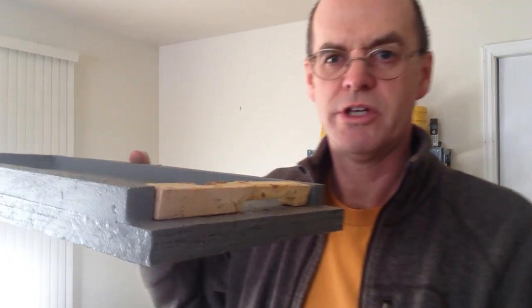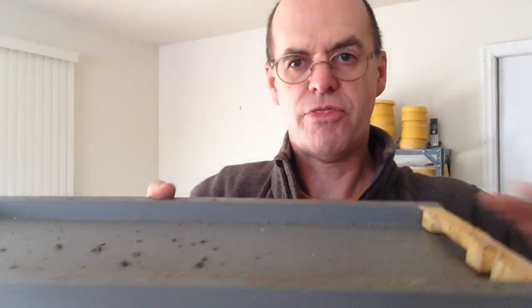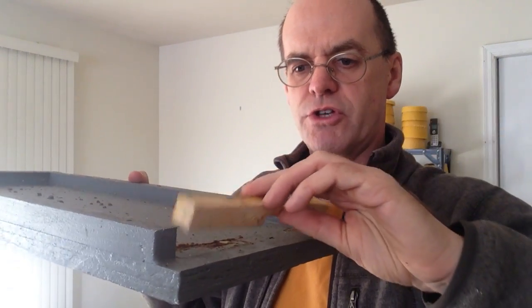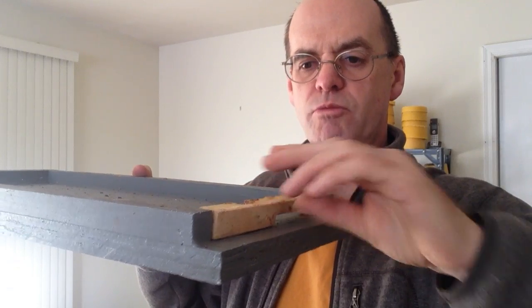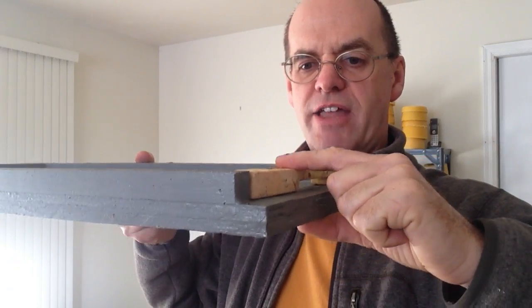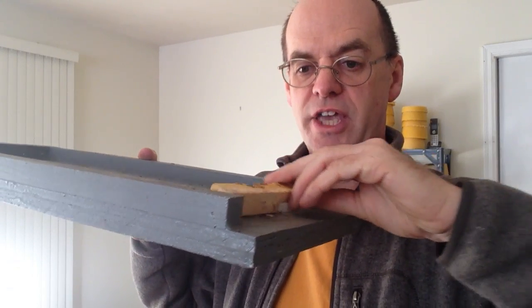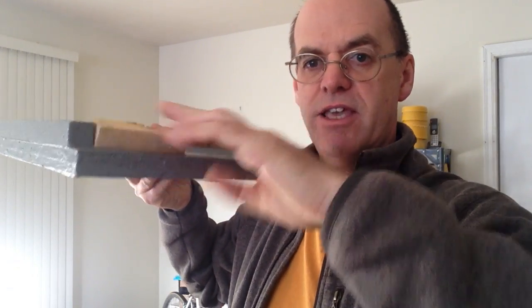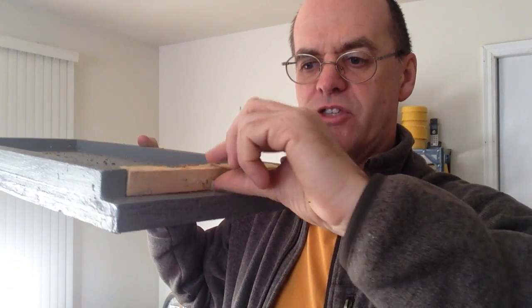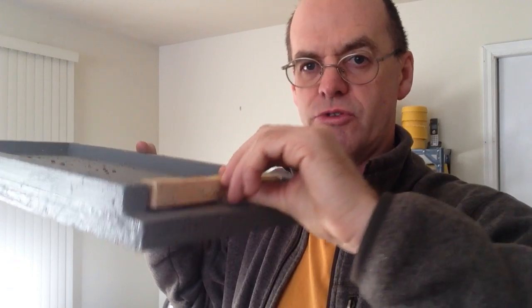The bottom board is three quarter inch plywood with rails on three sides. I make these little entrance reducers. My tip is: when you make the rails, if you make them a little thicker than standard one-by wood — which is three quarter of an inch thick — then the entrance reducer fits in easily. If you make them all the same size, when you get a few layers of paint on, you sometimes have trouble getting the entrance reducer in.